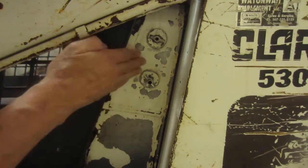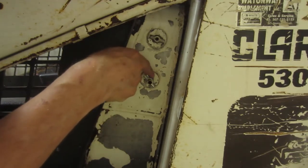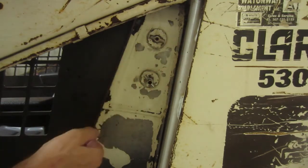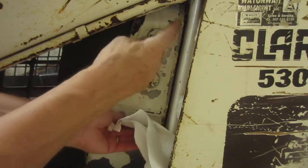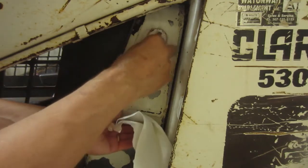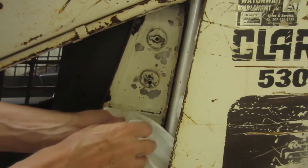Let me show you how this works. The oil level in this tank is designed to be somewhere between these two spouts. What you'll do is open up this spout to check it. If oil comes out of here, you have enough. When you're filling it, if it's coming out of here, it's time to stop. So as long as my oil level falls somewhere in between these two, I'm good.